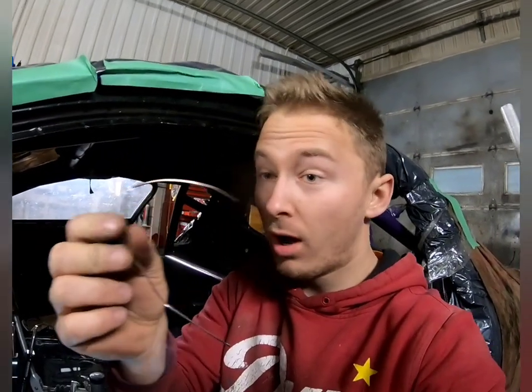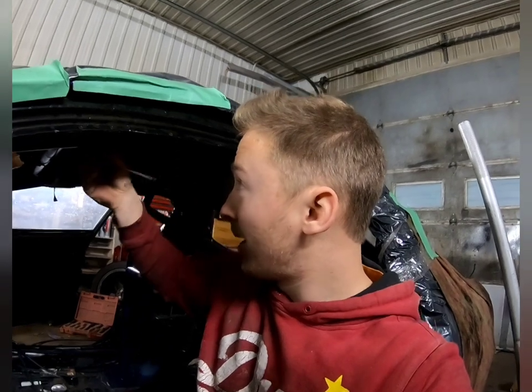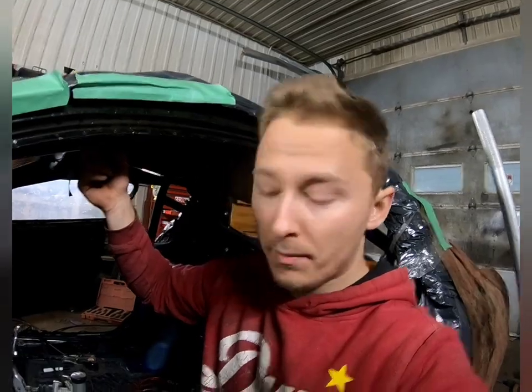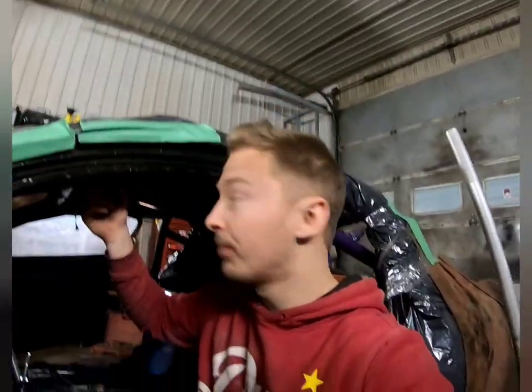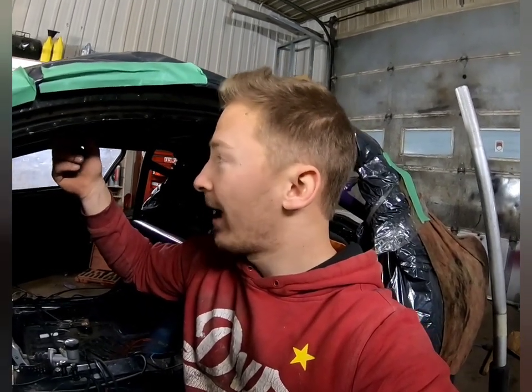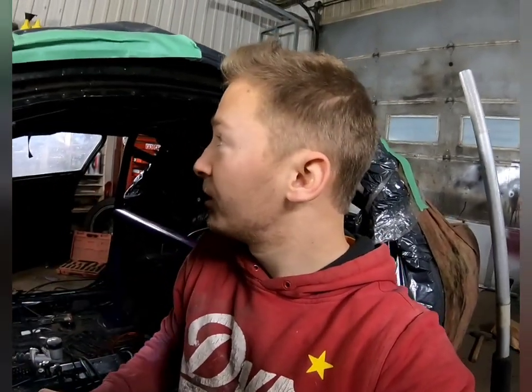Right now I have a rod that I'm going to bend and put around my tube, so when I have my TIG welder up there I can move it around and get into where I need to without having to focus on this. I just need to get some fill in there and it'll be good — as long as she's penetrating on both sides, we're ready to go.